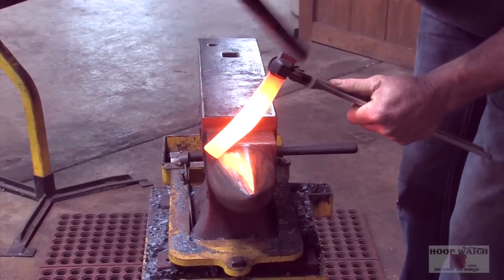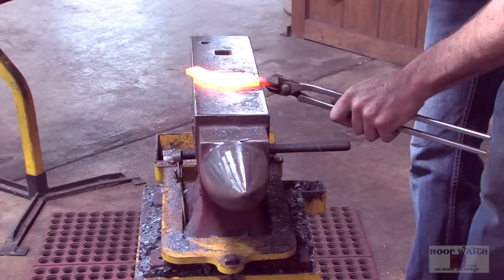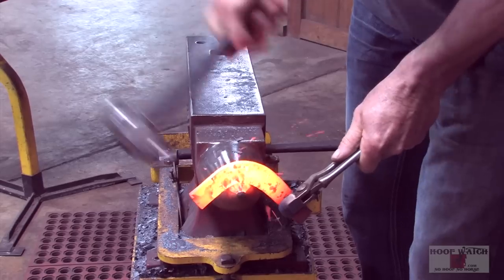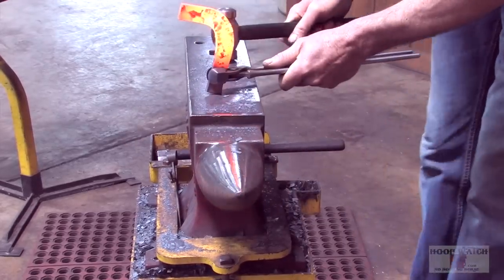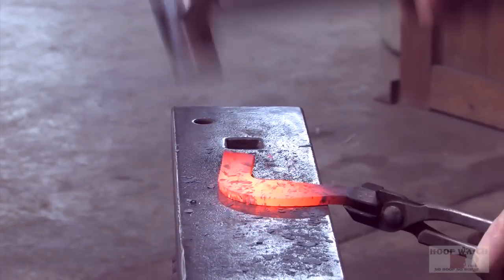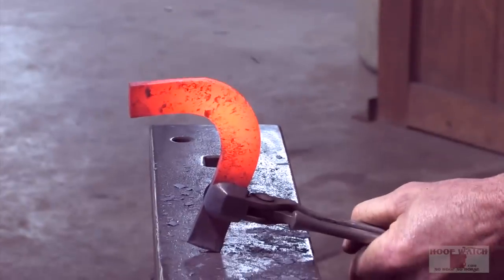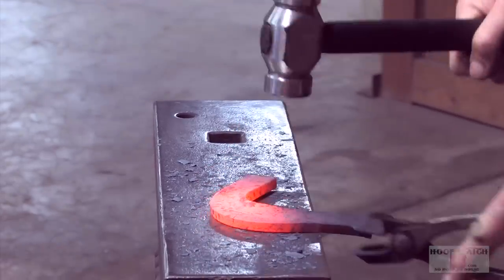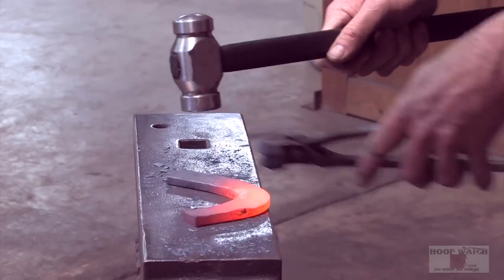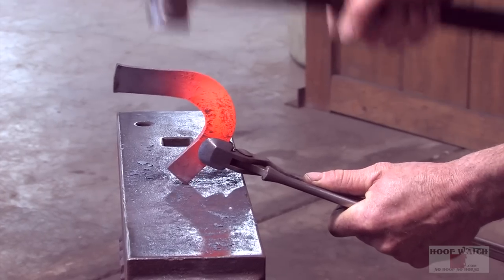We're gonna just focus right here on the toe bend, just on this one side. You can see how I already got it going to this one side a little bit. I'm just gonna come down here and hook it in. Now I can rebump my toe. I got it pulled down, and then I'm putting material in. This is just adding material the whole time. So we've got it upset right here. What I'll turn right around and do is hold this on the anvil, and I'll upset some to the other side now. You can see it upsetting into that corner.